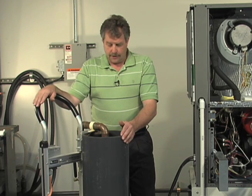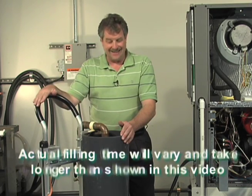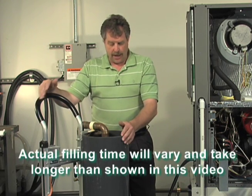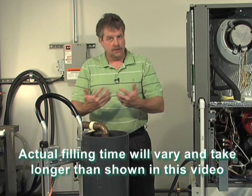However, there's a number of loops out there I've heard of that have been condemned when in fact they didn't leak, they just were improperly purged. Remember, your gases or your air pockets will compress, liquids do not.